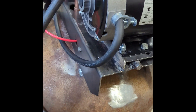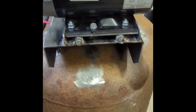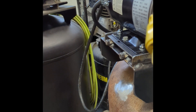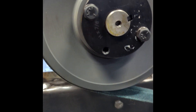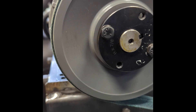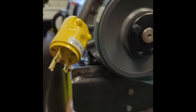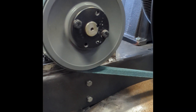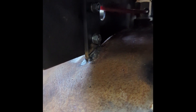This base is something I went to a local fabricator and had them bend for me. I cut the corners just like it's done on new compressors. I bolted the base to the tank — rather than welding — so that if I ever want to switch tanks I can easily unbolt it. I took some flat iron, drilled holes, bolted it onto the base, and then welded it onto the tank.